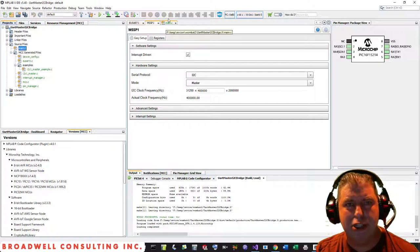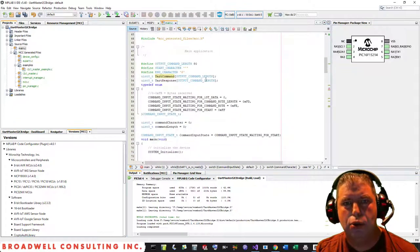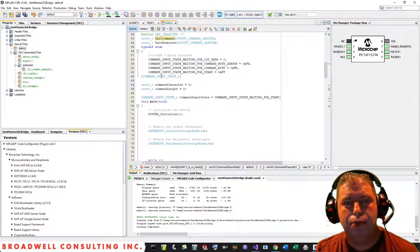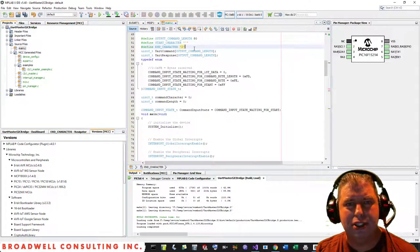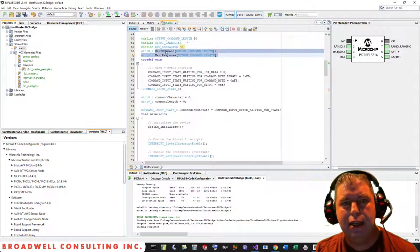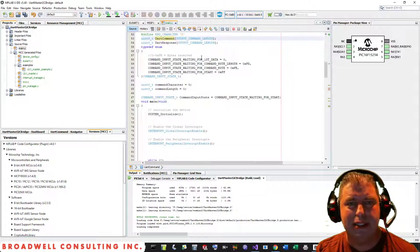This is a quick and dirty project at this point that'll be refined later. So all of the work is essentially in one big function. I set up a command protocol that would come in over UART. Pretty simple. Each command starts with a caret, ends with a dollar sign. I'm a fan of regular expressions, so that made sense to me. I've got a couple of buffers here that take the incoming UART command and put together a UART response.